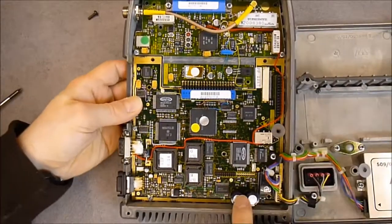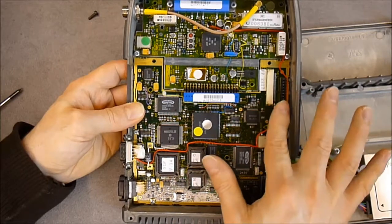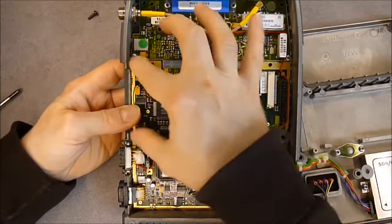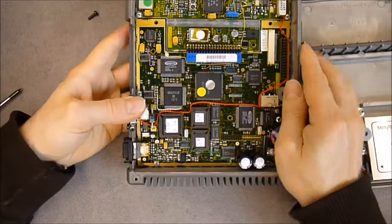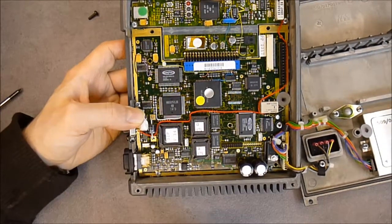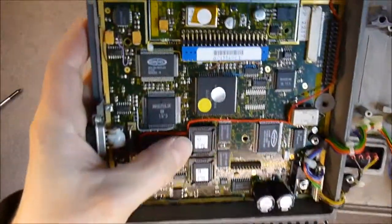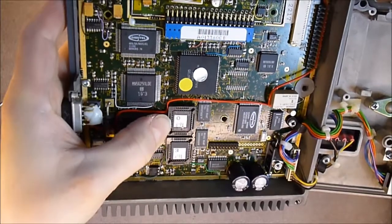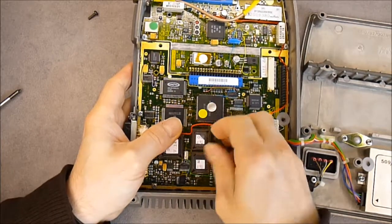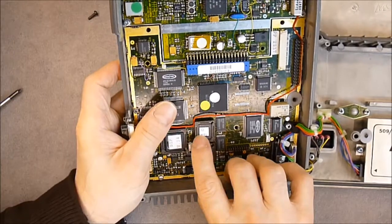Then here we have some little relay, flex connector and a header connector for optional things, it seems. It should come here, not sure what it is. The main chips, we have some proprietary chips with Orbital logo on it. Memories, it seems. Oh, look at these guys. Old-fashioned EEPROM, a microcontroller chip with a glass window on it for programming and a little sticker covering it. Really nice. And it is in a ceramic package.